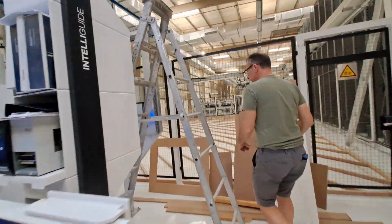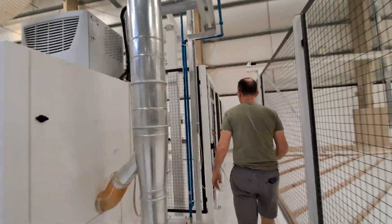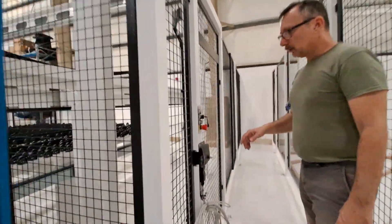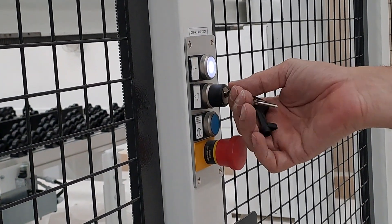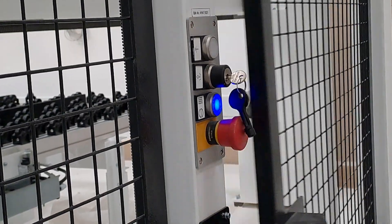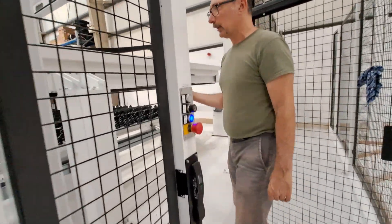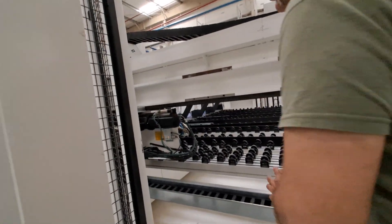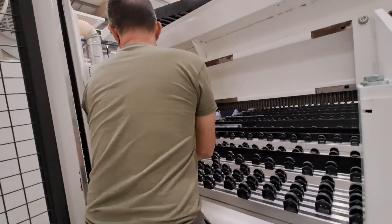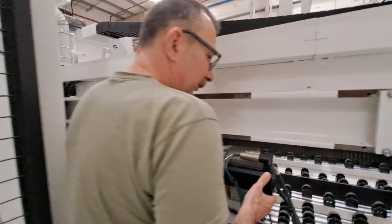Let's go to the door. To open the door, that's the request for opening — everything moving is going to stop — then turn the key, turn the handle, keep the door key with you so that nobody locks you in and restarts the machine. Here we have a very important greasing point, and that's the point we should grease twice a year.